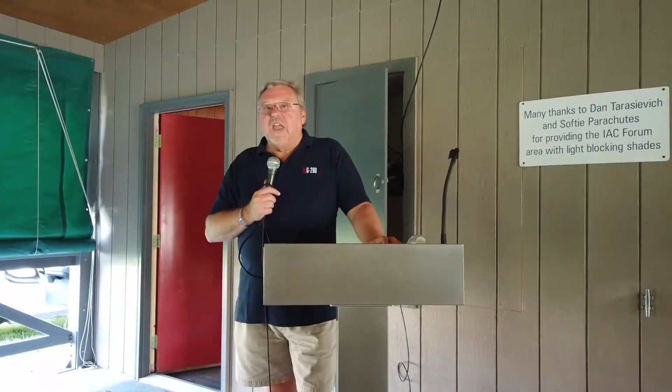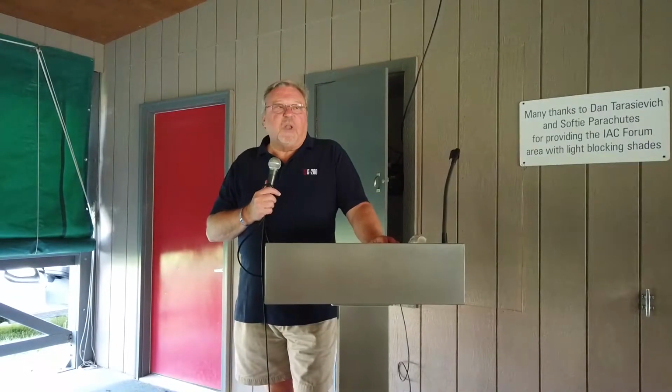So I already had most of the structural work done on the airplane as a steel tube, wood wing airplane. I gave all of that to Martin, and he agreed to convert that to layup schedules for a monocoque fuselage. And that was done and finished in probably 92, 93, we started building plugs and molds, and the airplane started going together. In 94, I finished the airplane and flew it on March the 7th, 1994, which was my daughter's birthday. I went out real early in the morning so I could avoid all my friends, and flew the airplane.